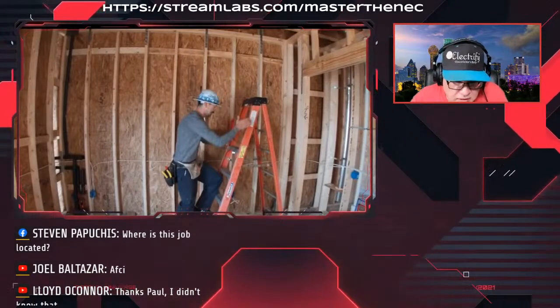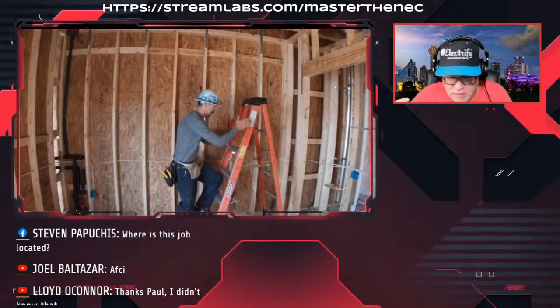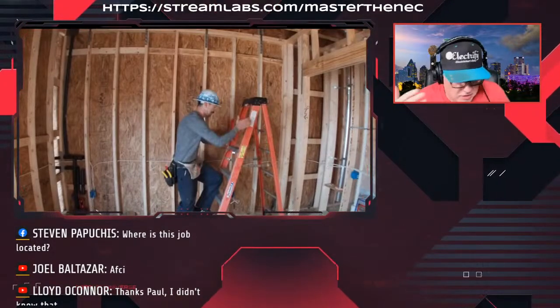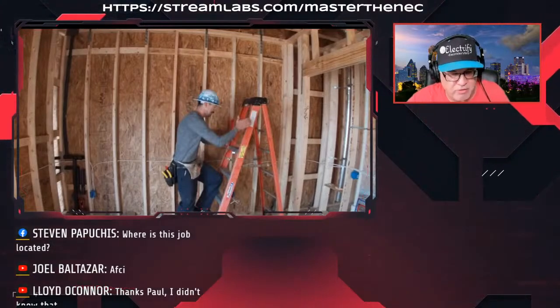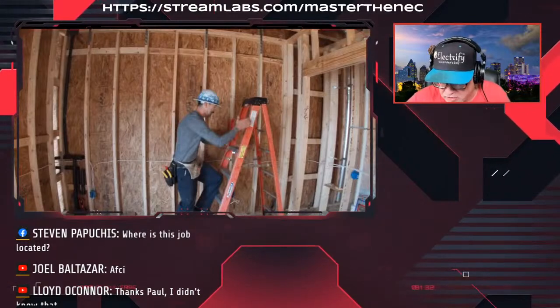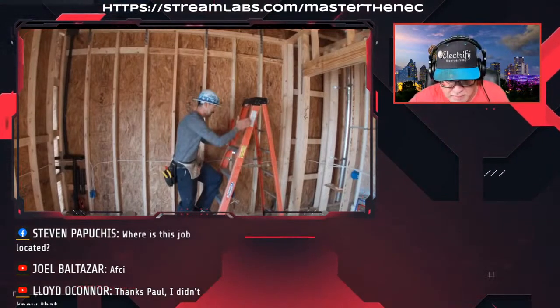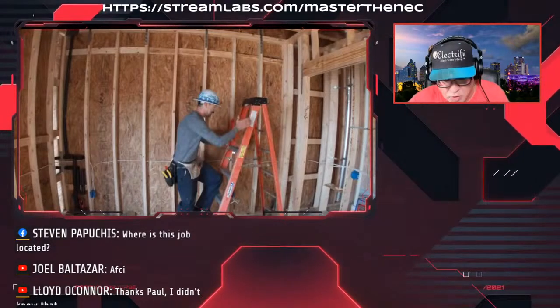He's going to put three cables in that box. So he's going to put three 14.2s. Okay, so let's assume that that is a Carlon cheapy, the entry level, 18 cubic inch Carlon. Now, this might be a 22, but let's just say it was 18. So for craps and giggles, we want to see if he's okay. So he's going to put a receptacle in there, and he's going to be putting three cables in there. So what would his box fill be? Again, I didn't anticipate that, but I said, you know what? I'm going to roll with it.